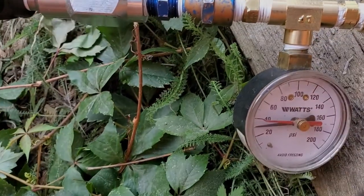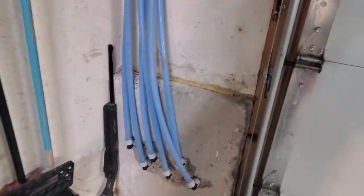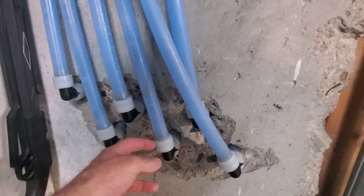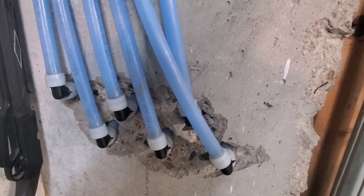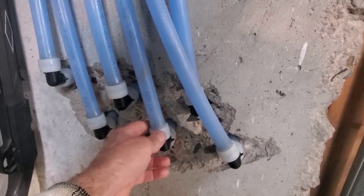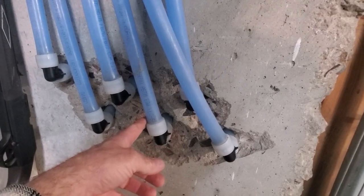It's been a few months since I laid out the tubing. Let me give you a quick tour of the inside and show you the hydronic control part of the snowmelt system. This is the tubing coming in from the driveway. I ended up using Propex fittings — a PEX ring that you expand with a tool, slide onto the fitting, and it slowly crimps back down making a really good seal. The advantage is it doesn't restrict flow like the Home Depot-type PEX crimp fittings.